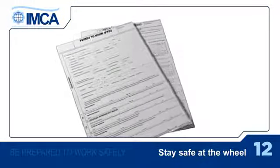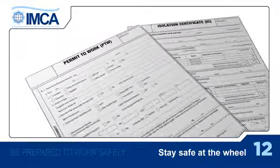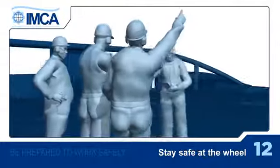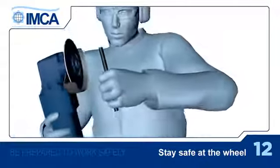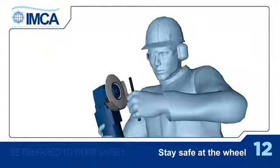If conditions are appropriate for using portable electrical equipment, raise any necessary permits to work and hold a toolbox talk. Test the wheel or disc by lightly tapping it with a non-metallic object. The wheel passes the test if it gives a clear metallic tone or ring. If it sounds dead, it is cracked, so don't use it.